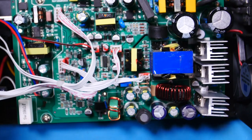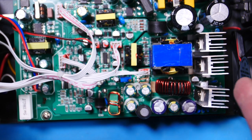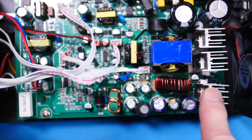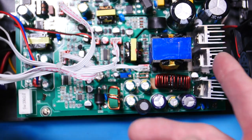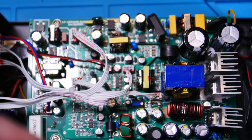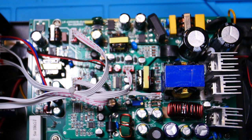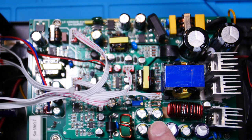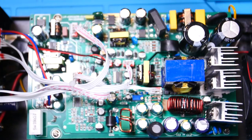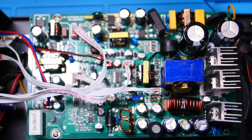So they're probably using at least one of them to turn on the fan, which is right in front of the fan. And then look at that, the fan's going to blow right into those heat sinks. So that's actually a nice design. Then the vents are on the side of the box, so the air is going to be pushed in and then pushed over to the sides. So it looks like the larger heat conducting parts, these resistors, are all mounted towards the side for that airflow, to get maximum airflow, I would think.